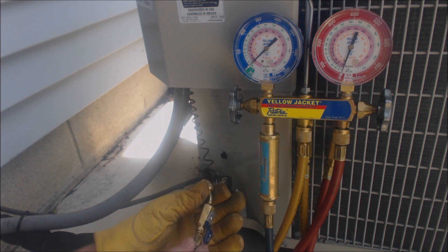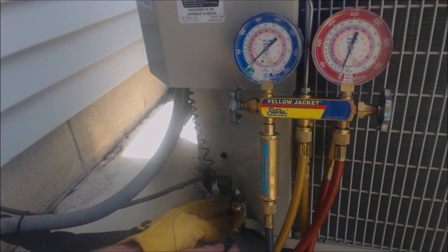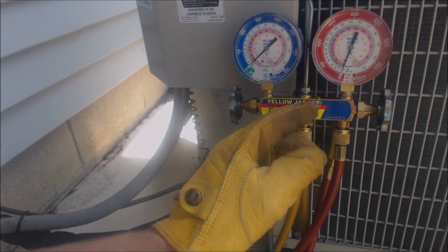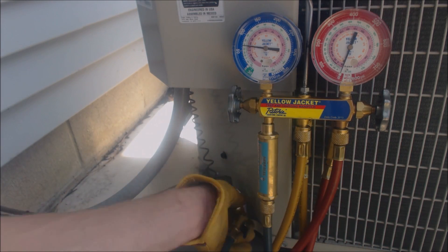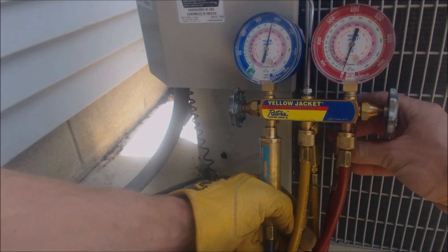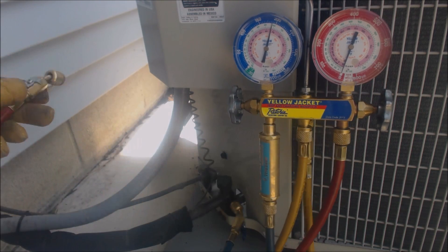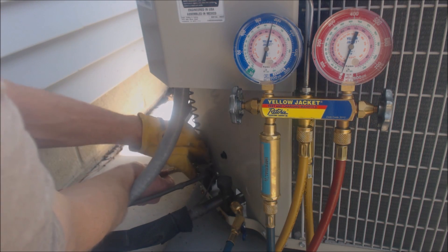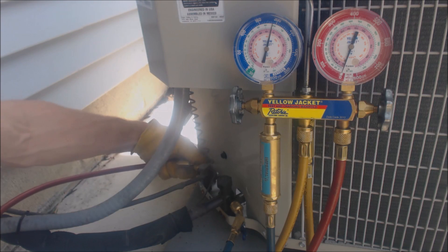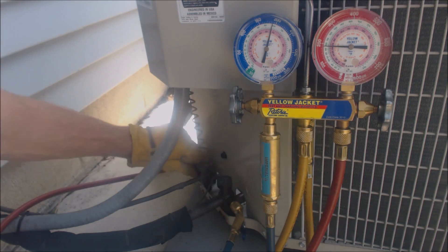I'm going to put a glove on here. You always want to make sure that this is pressed forward first — line it up and start putting it on. I didn't turn it tight enough to start pressing in the Schrader valve yet, and I already checked my gauges — my handles and hoses are all tight, everything is good. So we're going to go ahead and push it in. Our handles are tight, everything is good, we're going to press this forward and attach that fairly quickly.